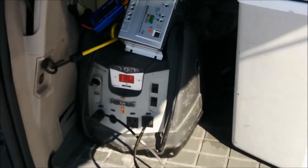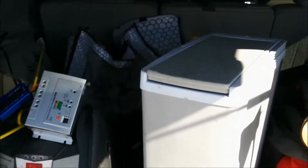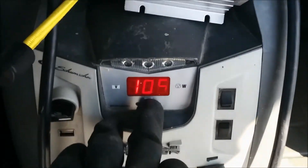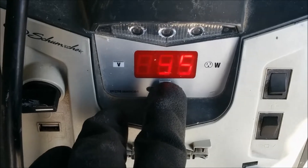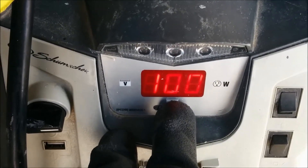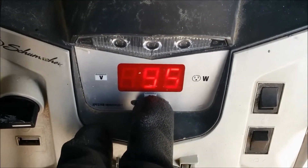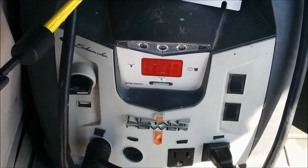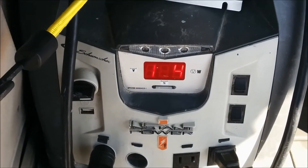And I'm able to run all this — this is going to be sweet for camping, just out of the Jeep or with the trailer. I'm very excited. You can see the battery percentage. I can't check the voltage with the inverter on, but the percentage is between 95 and 100%, so we're staying around 13 volts — which is awesome. When I shut the laptop off, I get 14.4 volts again with just the cooler running.